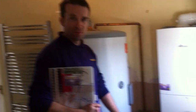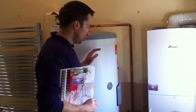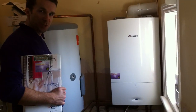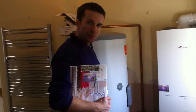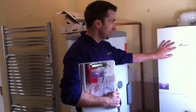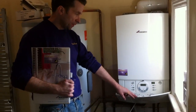There was originally an old floor standing boiler downstairs and a cylinder. We removed all of that and put a new cylinder in here which is mains pressurized. We've run a new mains pressure supply up from the cellar all the way up to feed here, to give us a really good excellent hot water flow rate and cold water flow rate, and we put a system boiler in here. This is a Worcester 30 CDI system boiler.